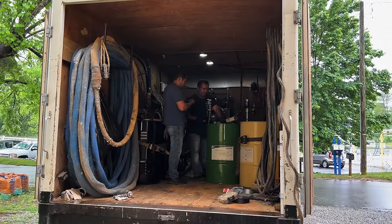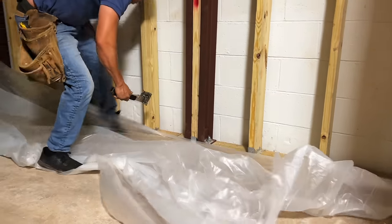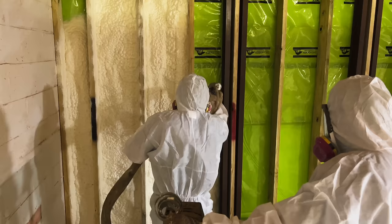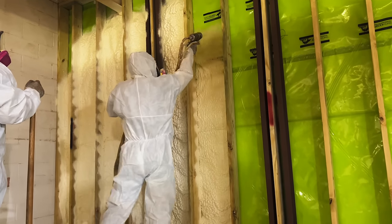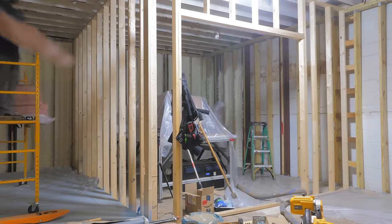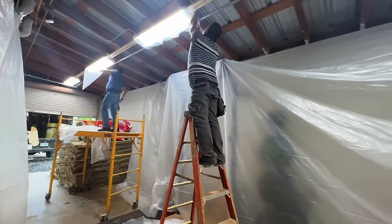Part of the crew worked on ceiling insulation while the spray foam crew got set up for spraying the walls in the shop area and the ceiling in the addition with closed-cell spray foam. They started with the walls, first masking off the floor since spray foam sticks to pretty much anything and is next to impossible to remove once it's stuck. In my case they sprayed a fairly thin layer of about an inch and a half thick — that's because I went with the flash-and-batt method, meaning the crew would add a layer of batt insulation on top of the spray foam. I went with flash and batt mainly to save money, using mineral wool insulation I'd brought from the old shop. The main purpose of the closed-cell spray foam was to air and moisture seal the walls.